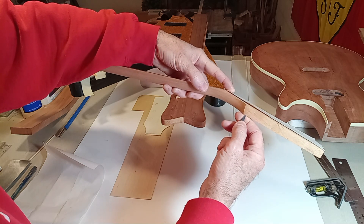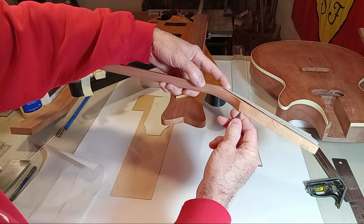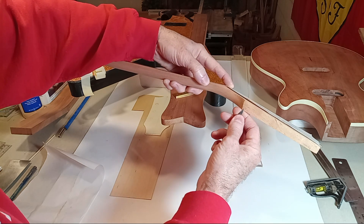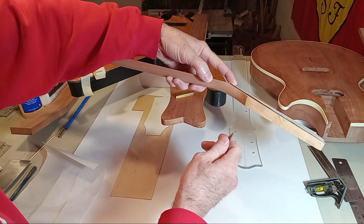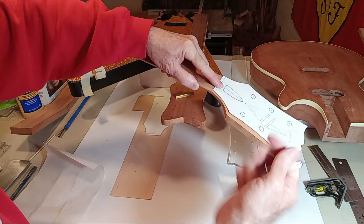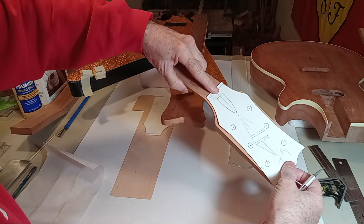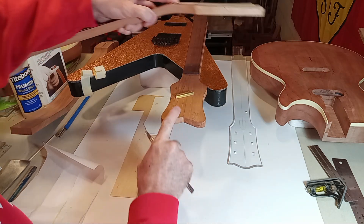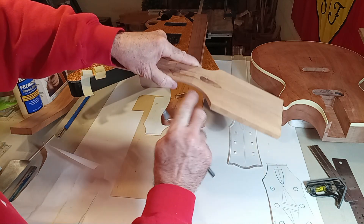What do you change? You don't change the top line — this being a flat line and then a 17-degree pitch. You change the thickness on the back. So whatever you add to the top veneer, say you wanted a target of five-eighths of an inch, you deduct it from the lower. In my past videos where I built the 50s custom black beauty and burst, that's exactly what we did. The headstock was exactly a half-inch thick up here and seven-sixteenths of an inch lower, right at the threshold — you wouldn't want to go any thinner.